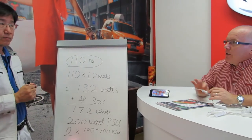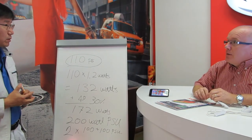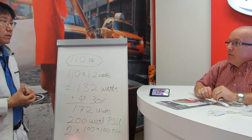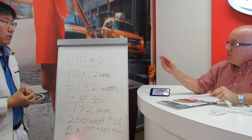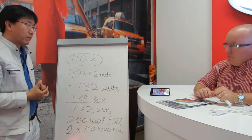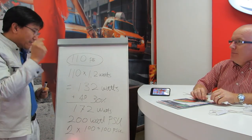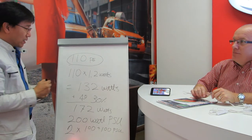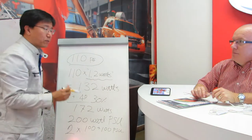So, if the module was running on say 2 watts, would I then have to replace that in the formula? Most definitely. Because each LED is different. So take the value of the LED module, put it into the formula, add on a safety factor of 30%, and then we will be okay. Thank you very much.